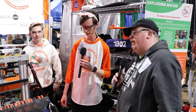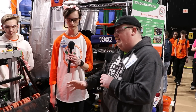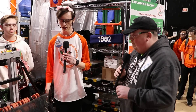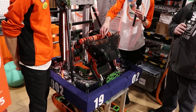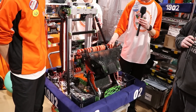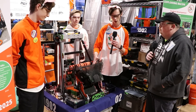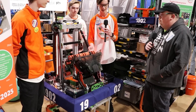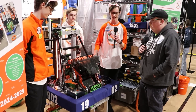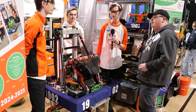When designing this intake — in 2023 a lot of teams had issues with the cones because it's not a shape that is the same on all sides — did you guys specifically test anything to deal with the coral, which is very similar? We actually did a prototype that looks almost identical to this one, with horizontal wheels and vertical wheels in the back. We tested a bunch of different compression levels and wheel positions, and found one that worked along with these plate angles. We took it to CAD, got it manufactured, and it's worked great — it took a lot of prototyping.